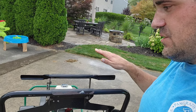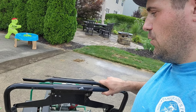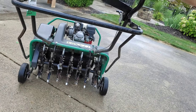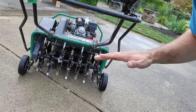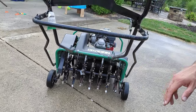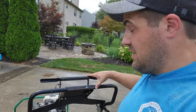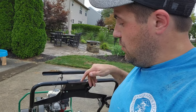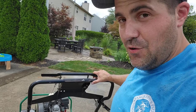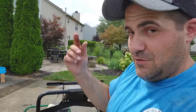This operates very similarly to a lawnmower. Once started, you pull back and hold the handle to engage the tines on the bottom. As soon as you pull it down, the tines start digging into the ground and the machine becomes self-propelled. One thing everyone experiences when renting these: if you just full-blast pull that handle, it will take off very quickly and can easily tear up your lawn. Ease into it gently when you first get started.